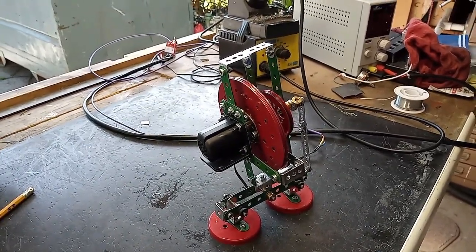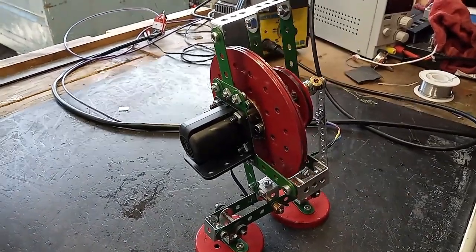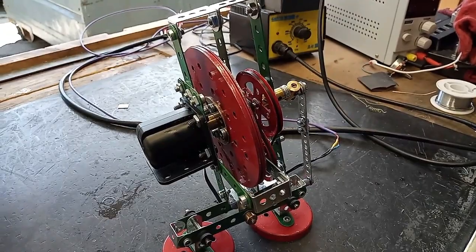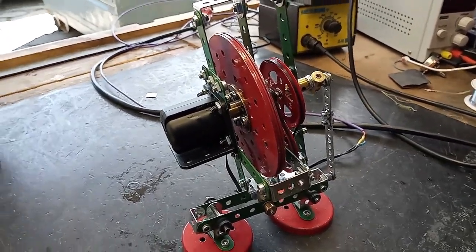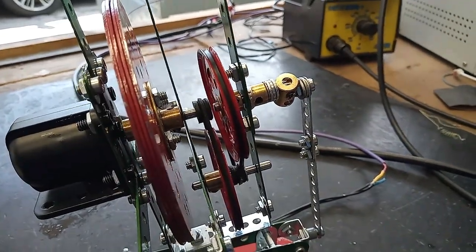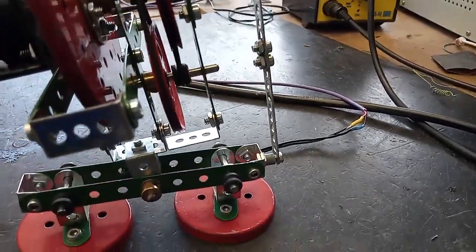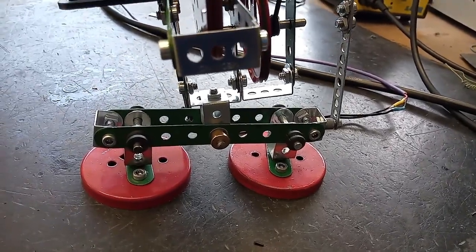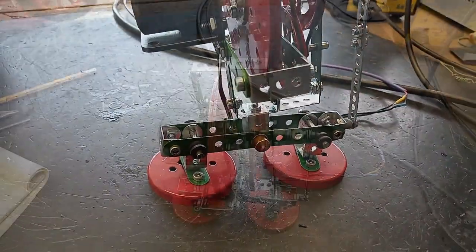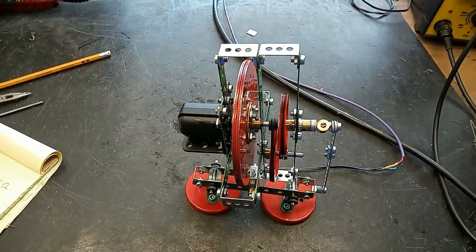This is my rebuild of it. There's a motor which drives this heavy flywheel, and then there's reduction gearing with two pulley pairs, and then a crank and an arm moves the two feet up and down to provide a walking motion. I'll show how it works without him walking,